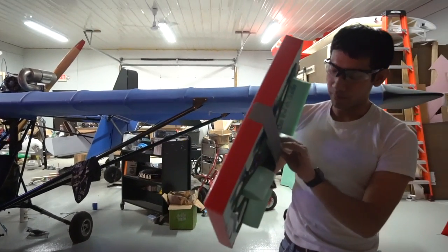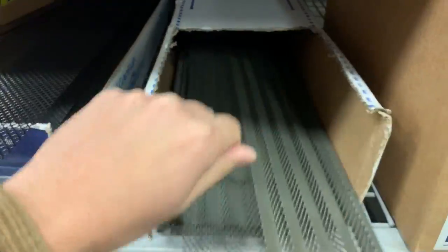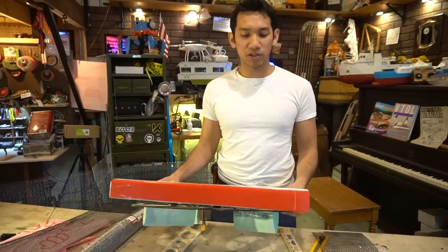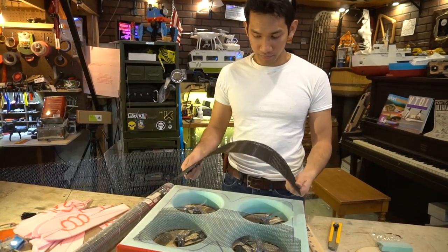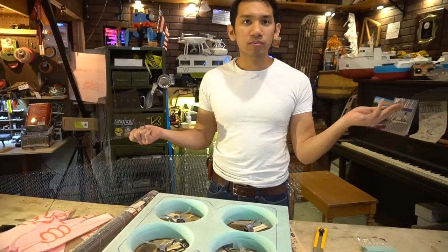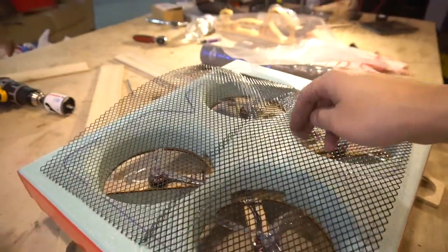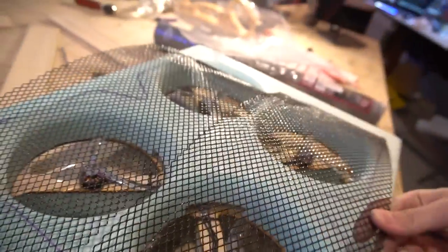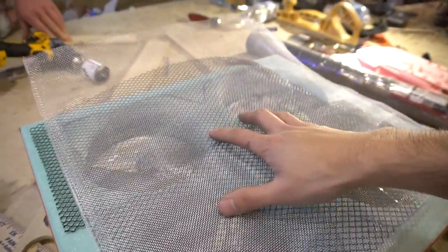So that's not bad. Everything's cold. All right, now we need to work on the grates and figure out how we're going to stop crap from going inside of this, and also we need to be able to fly accurately. So we got eight minutes of flight time, I'm very happy with that because I'm pretty sure these battles don't last more than a few minutes. I'm trying some screens to figure out the best way to protect these props. The idea is to use something heavy-duty, because this is metal, so quad blades on most drones should not be able to cut through this, but they can cut through this aluminum stuff, this thin mesh. So this is to protect it from the majority of propellers and from string and other small stuff competitors may throw into our drone.